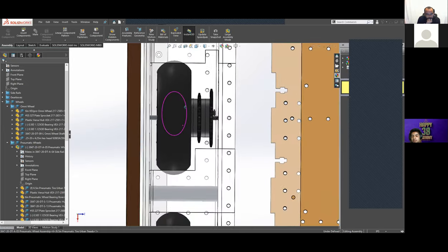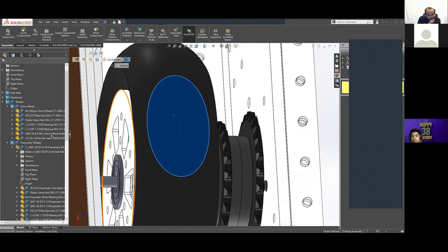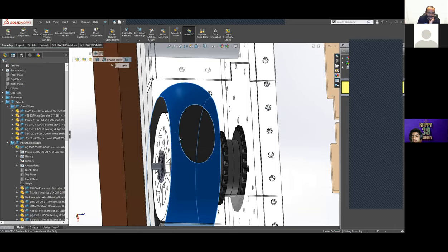Yeah, and then the wheels themselves are from, what company? Trampa. Yeah, Trampa tire, Trampa board, something like that. They're a UK powered electric skateboard company. They're a little bit bigger than 6-inch diameter, but when you actually inflate them and get the robot weight and everything on them, they sit about 3 inches off the ground to their center axle, which works out nicely.